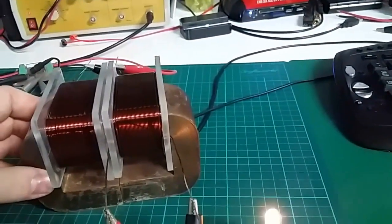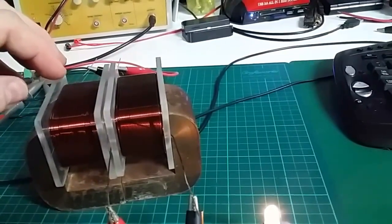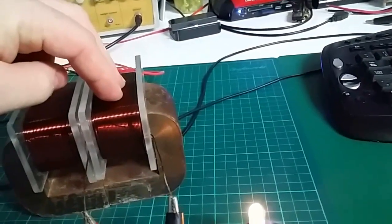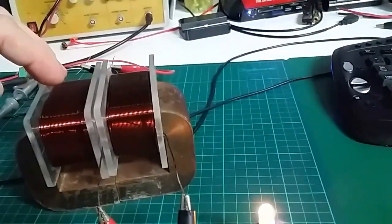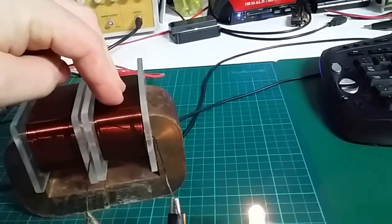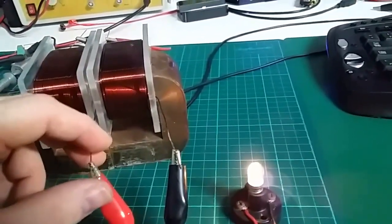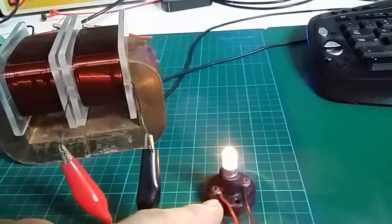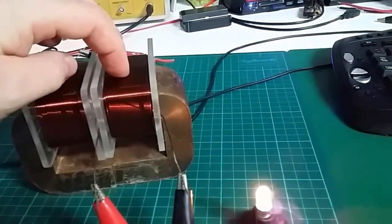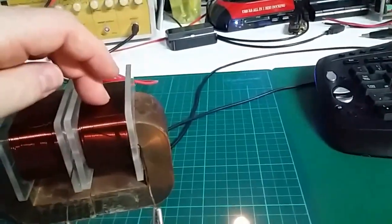And if it's coupled nice and closely, then we get a better EMF. So again, I just want to reiterate, current changing on this coil creates voltage on this coil, not current. It creates voltage. Current changing in time creates a voltage on the secondary. When the secondary is loaded, Ohm's law predicts the current. The resistance of the coil and the resistance of the load then determine the current that will flow. Now, if there's no load on the coil, no current, but we still generate an EMF.